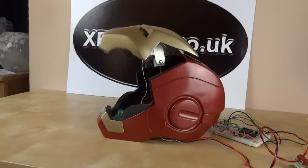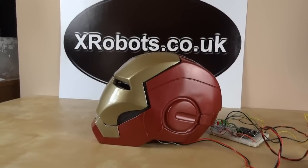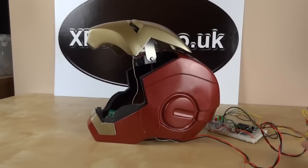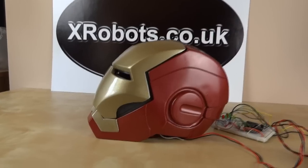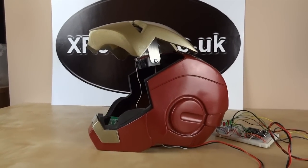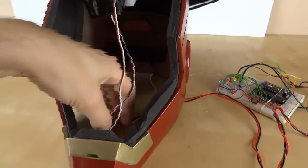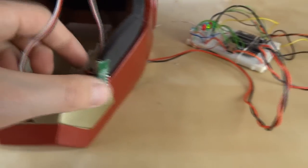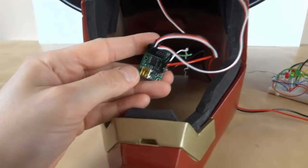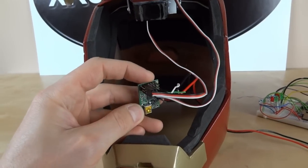So that's basically how it works — let me just turn that back on again. I've actually programmed waypoints in there so that it lifts up and goes down with this nice motion. Sometimes it gets caught on the foam at the front. I'm using a Pololu Mini Maestro six-channel servo controller, which you can see in the front here — this tiny board — which will eventually have all the electronics tidied up and put inside the helmet. It's got six servo channels, and you can also configure the spare ones for digital in or out, which means I can use the spare channels to turn the lights on in the eyes.